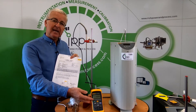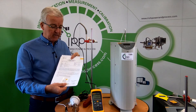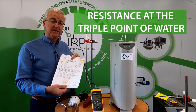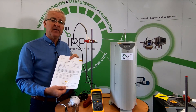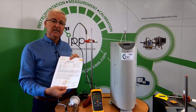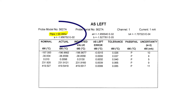When you purchase a calibrated thermometer or send it for recalibration, you receive a certificate from your vendor. The critical value on that certificate will be the resistance at the triple point of water. The calibration lab will have tested it and put a value somewhere in the region of 100 ohms, or 25 ohms for the 25-ohm PRT. Here's an example of a calibration certificate showing a resistance at the triple point of water, or TPW value, with a resistance in ohms.